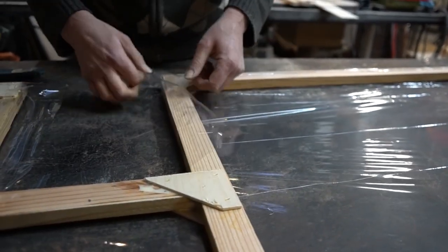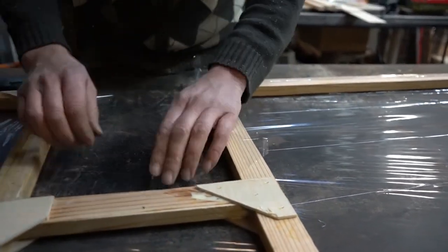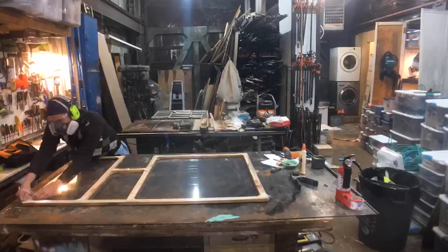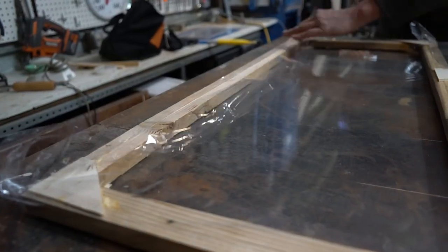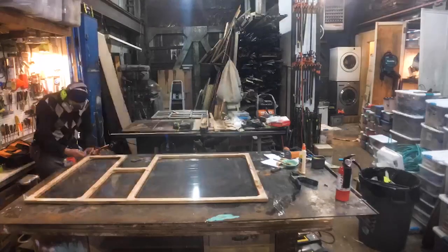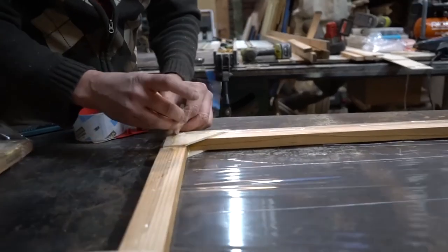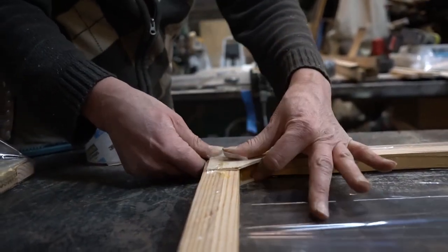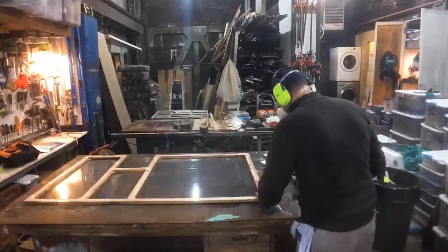Make your maximum panel dimensions at least 4 inches smaller than your shrink wrap. This greatly speeds up the process of stretching it. You will, however, need to trim it. Taping these corners is purely aesthetic, but for such a rough construction, every little bit helps. You of course want to feel pride in your work, and the workers behind this barrier will appreciate the detail.